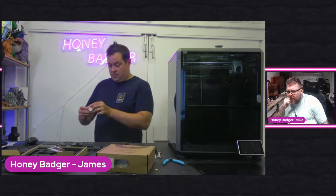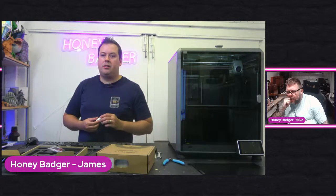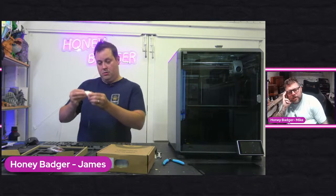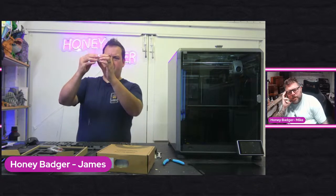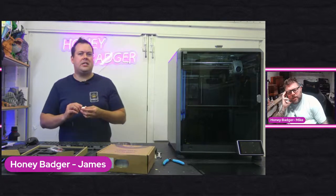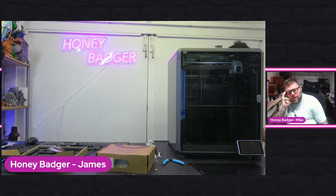It's very smooth. Apparently, Creality are making the K1, K1 Max source code open this month, because I don't think you can adjust the Z offset at the moment if you need to. So I wouldn't say there's an elephant's foot on that. I wouldn't say there's too much squash on that. I'd say that's pretty bang on, to be honest.